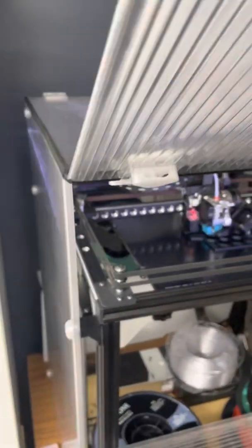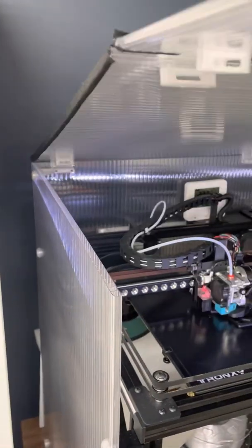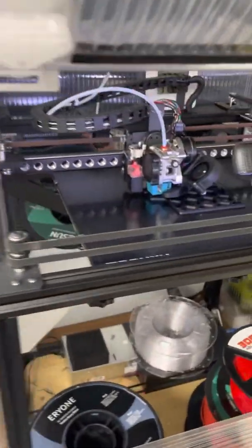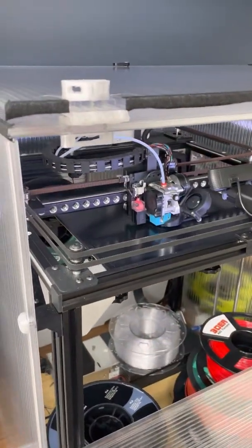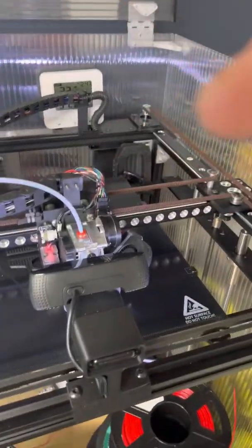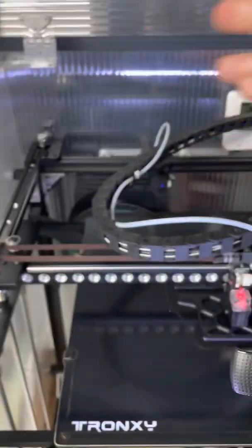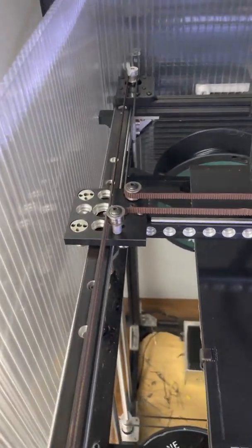The front of the enclosure is simply attached to the frame; the sides are attached using standoffs and these allow the sides to clear the moving print carriages. The top of the front is hinged and then the top is also hinged, so this allows us to leave just the front open for PLA printing. When we need to do a total rebuild we can open the top and lean it against the wall. Of course you might say, why would you want to do a total rebuild? Well, it is a Tronxy after all.